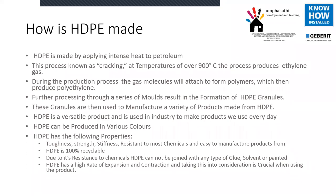It's very resistant to chemicals. Because it's a petroleum product and has a waxy finish to it, you cannot join it with anything like glue, silicone, or solvents. You can't even paint it — you can put the paint on but it will come off as the pipe expands and contracts. The next most important thing with HDPE is to know that it has a high rate of expansion and contraction, and if you don't allow for the pipe to move, your system will eventually either pull pieces of the installation apart or it will fail itself.